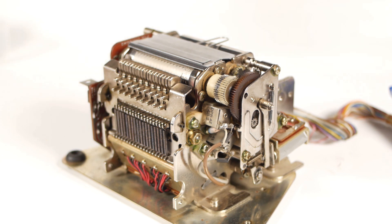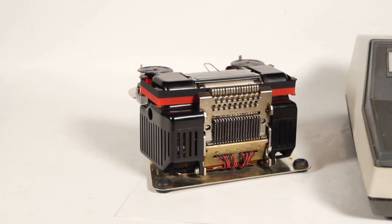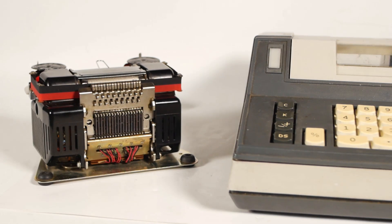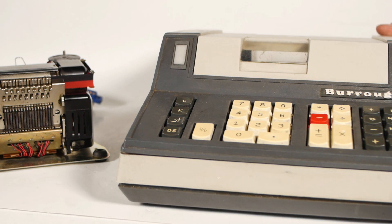That's a problem to solve once I've got a replacement gear. I've already ordered a pair of gears of the correct size and pitch, and when they arrive, I'll have to make some sort of hub to mount them together as one, and also create the correct bore size. I got what I could, but the two gears have different bore sizes, so the smaller one will have to be opened out and a hub that I'll have to make inserted and glued in place. I'll hopefully post an update once I've got the parts and I've got the printer back working again. After that, I should be able to demo the calculator itself. If you've enjoyed watching, please like the video and maybe subscribe to the channel, and don't forget to click on the bell icon so you get notifications when future videos are released. Thanks for watching, and I'll see you in a future video.